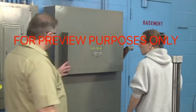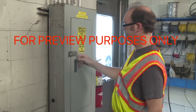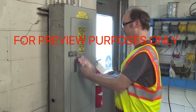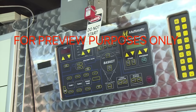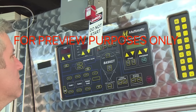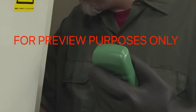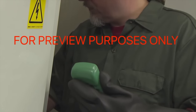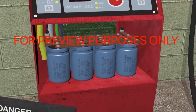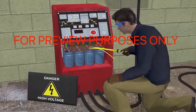If there is more than one source of electric power to a machine, it may be easier or necessary to lock out a main panel. Once lockout/tagout procedures have been completed on the electrical system, you should try to start and operate the equipment — if your lockout has been done correctly, you shouldn't see any movement. You also need to test the circuitry with a voltmeter or similar device. Don't forget — if there are capacitors integrated into the electrical system, they may contain stored electrical charges, and you will need to ground the capacitors before starting your work.